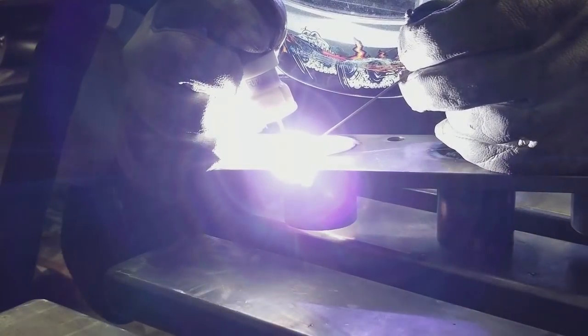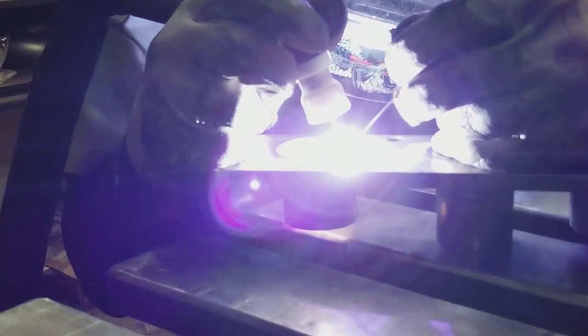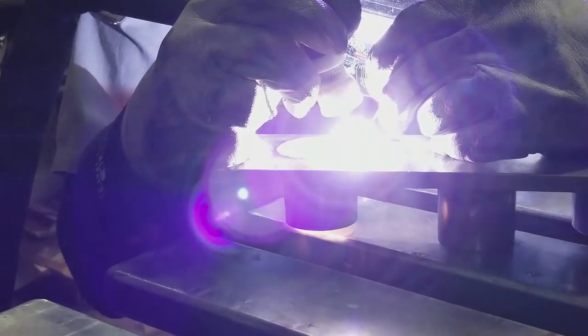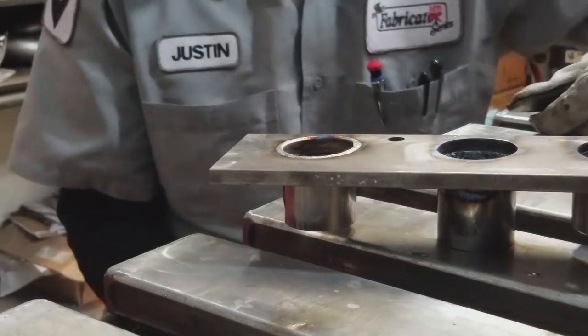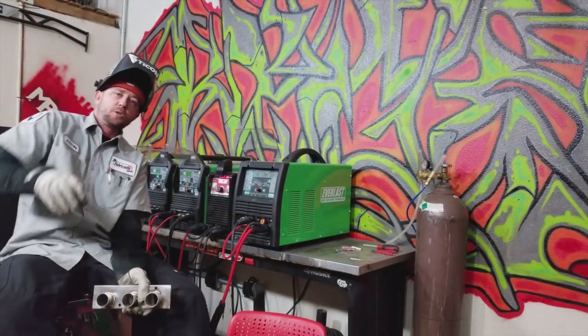I have one more piece — this is where you see an extreme example of focus in a different direction. Remember the first piece of stainless where I said we'd weld both sides? This is the back side of that piece. Look very carefully at where the focus is versus where the edge of the tube is. It's very important that your focus stays in the right spot — otherwise that section of tube gets superheated, the flange doesn't get heated at all, and the whole thing falls apart. The entire project — every piece, mild and stainless, tubes, pipe, and backside — was done at the exact same amperage of 100 amps, full throttle the entire way through every single joint. All you've got to do is focus.